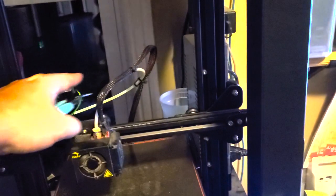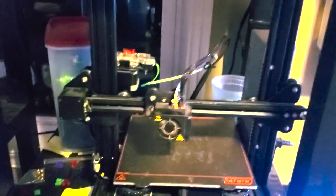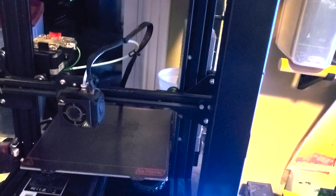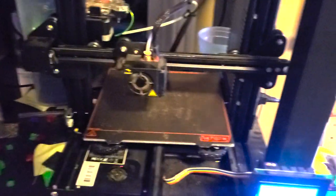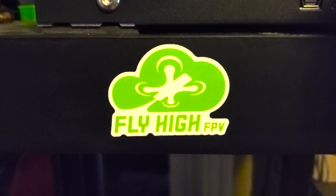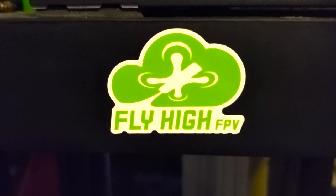And then you're going to ask for another 100 millimeters. And then you keep doing that until you get exactly 100. Being able to get your E-steps right is so important, because that's going to control how much plastic is squirted out. It's like the most important factor on your printer. Besides having it all squared up and snugged away and tight so that it's not loose and wobbling, getting those E-steps calculated is right up there at the top. And it's so easily overlooked because people don't know what E-steps are and it seems scary. But I'm telling you, it's not. It's easy to do. And just make sure you've got a good base to get started on and jump right in. 3D print your heart out.